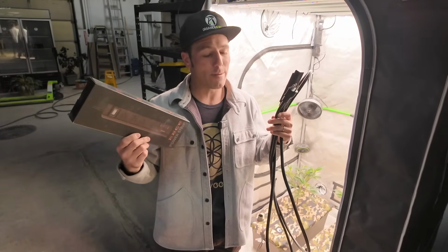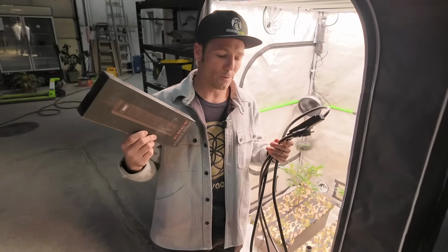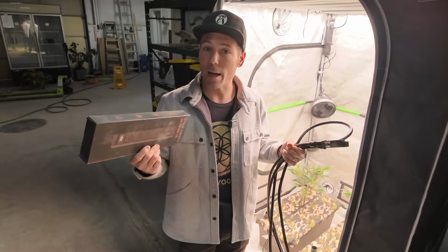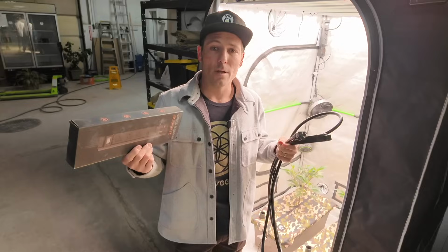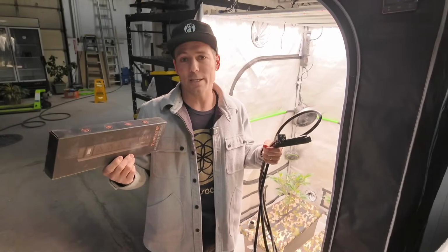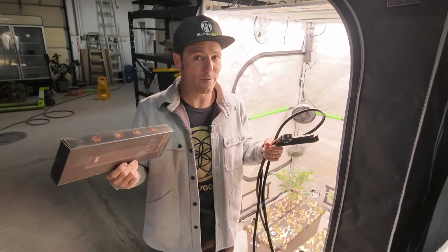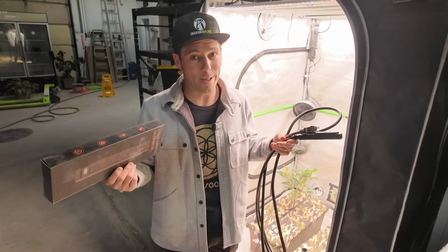It's too much. And what I mean by that is, if you don't know what you don't know, you might read on your breaker and say, oh, 20 amps. And maybe you look it up, and maybe you find out, okay, I've got 15 amps plugged in, I'm good. But 15 amps running 24 hours a day is very different than 15 amps run for a few minutes.